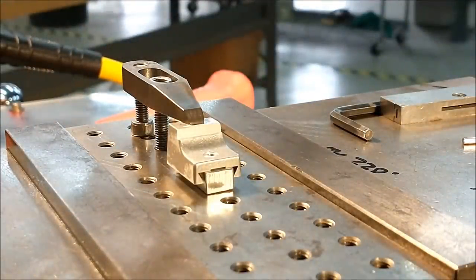That is a minimal spot face for the nut that will hold the feature that holds the lead screw. It's got to be just very superficial, and I am clamping on a shim so that it does not hit the bottom and distort those dovetails.